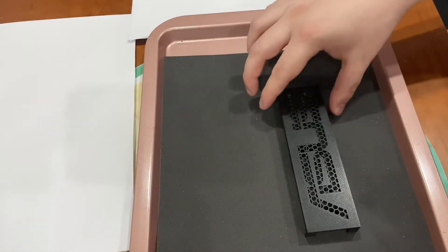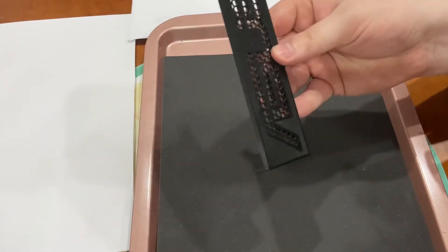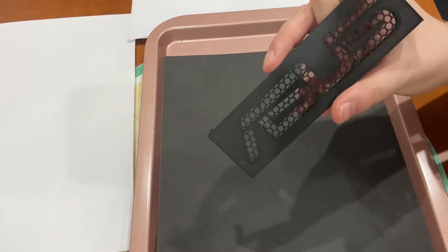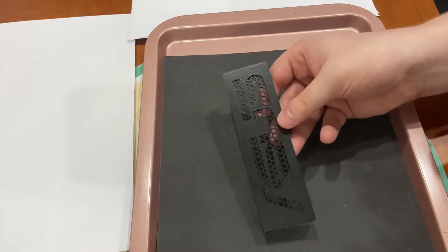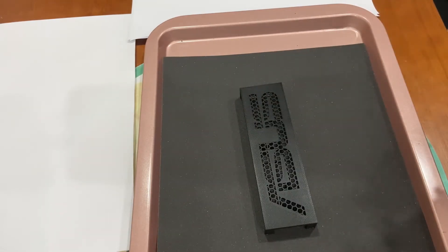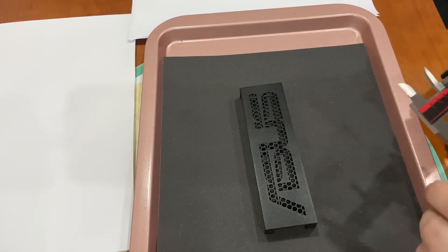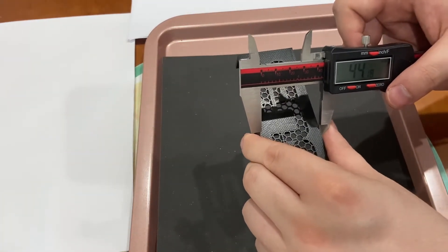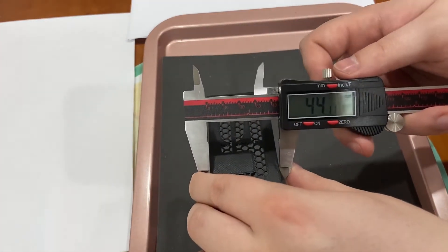I'm going to start out with the plate on this one. Our blanking plate here is very nice work by Mr. UltraNub, much appreciated. But the problem is it's only slightly too big — only half a mil bigger. We need to be at around about 43 millimeters, and at the moment, getting my vernier calipers here so you can see, we're at around about 44.